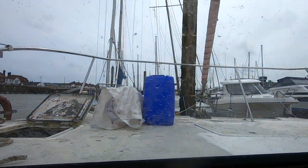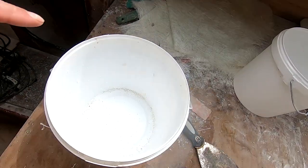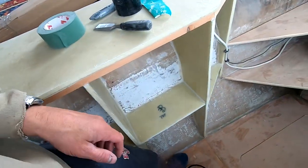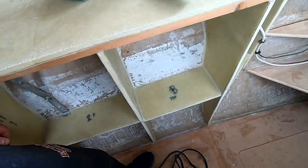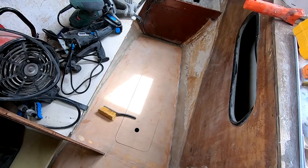Out there I've got my rather large drum of acetone and a big thing of rags. I want to get a bucket, a bit of acetone, and rags, just get in there and get rid of that bloody unhardened topcoat. On a good note though, the epoxy redone along there is working well.